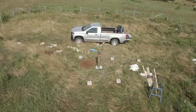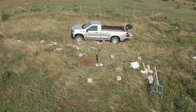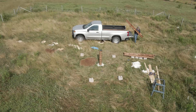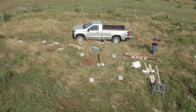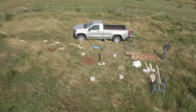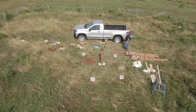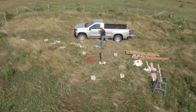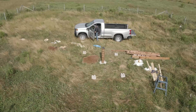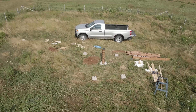A lot of this I figure I can put together without too much trouble. After all, the floor of the observatory is essentially a floating deck. Building a concrete pad around the pier would certainly give a sense of greater stability, but in these parts it's not really feasible. I live on top of a mountain, so there's no chance of flooding — water can only go down from here. But in winter it can snow as much as two meters. I need a foot or so beneath the floor for water to run off; if I were to build directly on the ground, the inside of the observatory would be a pond for a couple weeks during the spring runoff. So, floating deck it is.